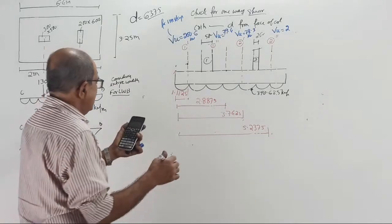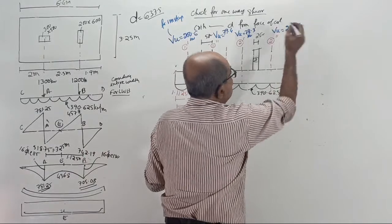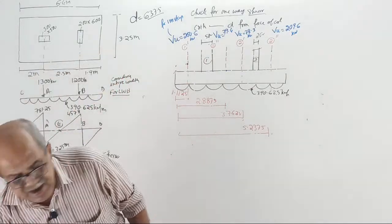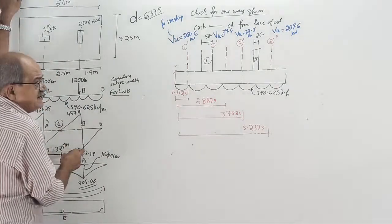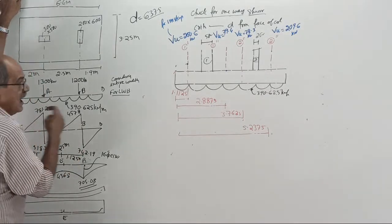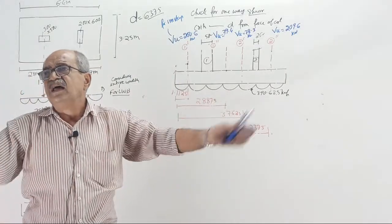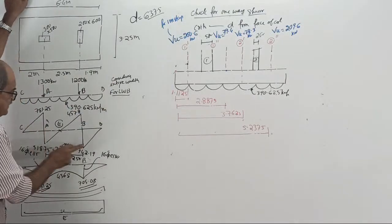Yes. See, 209.6. Can you tell me why I got doubt? Suddenly, I told you, this is called structural common sense. When I looked here, this side shear force is 781. This side shear force is 742. So this side is slightly less; earlier question solved. Inside was critical, outside was lesser. Now reverse: outside critical, inside lesser. Why? Overhangs are more. Here, high shear force, a little lesser.